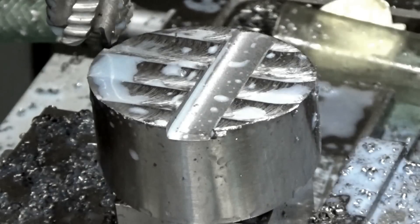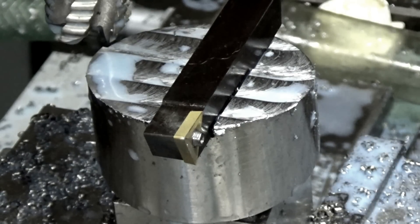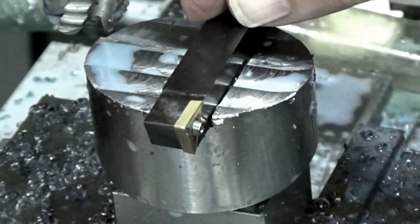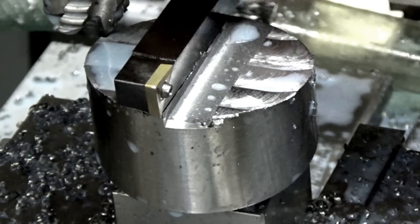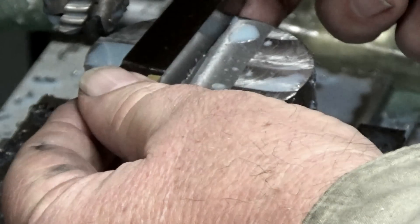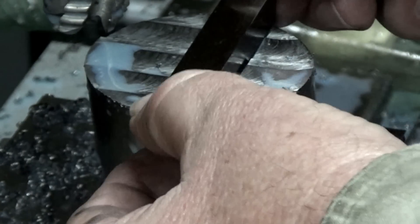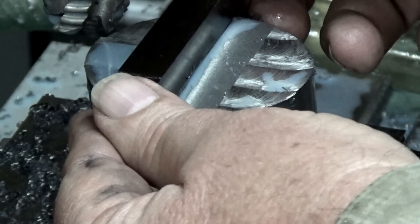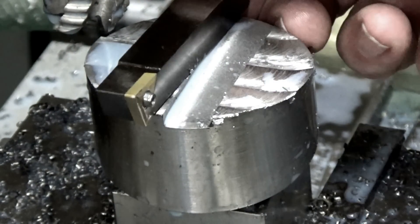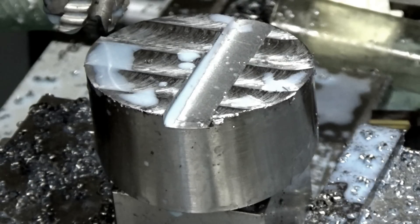I always want to admit my mistakes because I'm just learning anyway. I made a mistake when I was doing the calculations on this fly cutter. As you can see, I had a nice groove milled in it, but the cutter has actually got to be on the exact center line — and it wasn't. The center line is way over here. I think I could do a lot better if I learned some kind of drafting or 3D modeling program. So I'm machining off the entire thing. Luckily I made it big enough — I've certainly got enough room on this giant monster of a fly cutter. What I'm going to do is move the center line over to where the cutter actually falls on the center line. I've got a big roughing end mill here and I'm going to continue hogging it out and start over again.